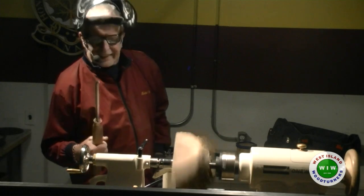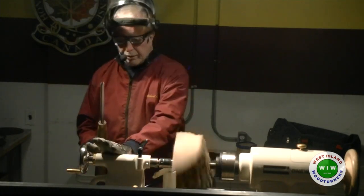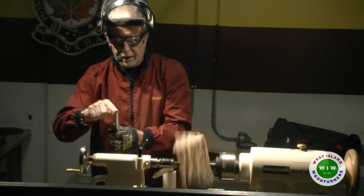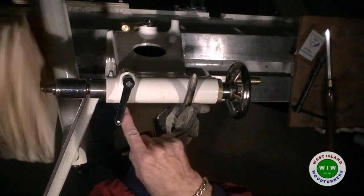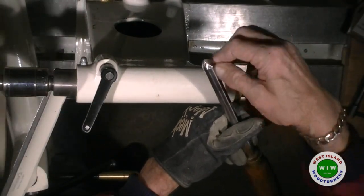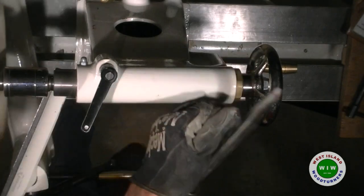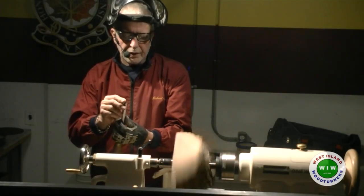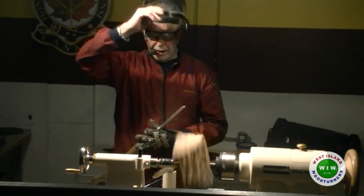This is Mr. Batty's 40-40 grind gouge. And to grind it, you put your plate on your grinder at 40 degrees. This is the 40, between the axis and the bevel. And you mark 40 degrees on each side of center. You just lay the gouge on each side until the flute is horizontal, and you just bring that round to the other side, and then you can just spin it, and you get this lovely all equal cutting edge all the way around the work face. So whichever way you've got this gouge to turn, it's 40 degrees, which is handy.